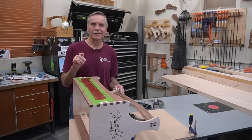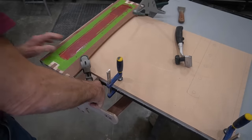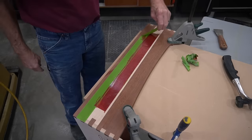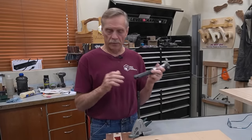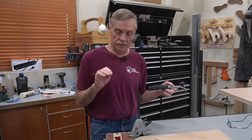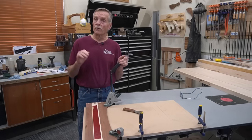So watch and learn. Well, I clamped the tool tote at a good working height like I did before during the belt sanding phase, and peel off the frog tape to fully expose the epoxy-filled lettering on the tool tote banner strip. And you'll see that this simple tool is my secret weapon for cleaning up the epoxy on this, because every other epoxy-filling video I've seen on YouTube resorts to sandpaper at this stage to flush up the epoxy with the wood and remove all the excess.